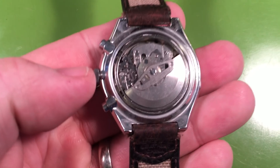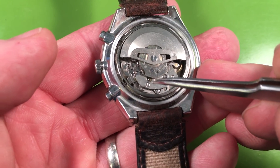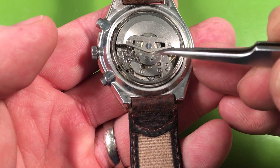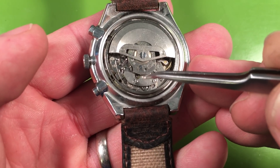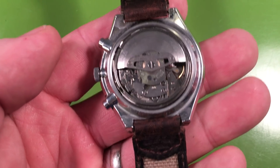The reason the watch stops at 58 minutes is because your minute counter wheel is super gluey. I can manually move it — you can actually see the bottom of the wheel right here. The chronograph wheel is underneath and has a finger on it that goes tick tick tick, pushing over the intermediary wheel, which then pushes over the minute counter wheel. Your minute counter wheel turns, it's just really gluey, but physically and mechanically it's fine — it just needs to be cleaned.